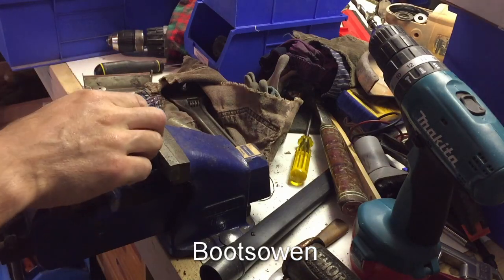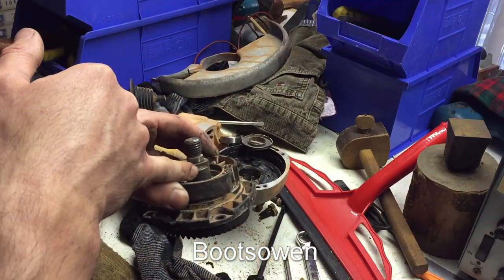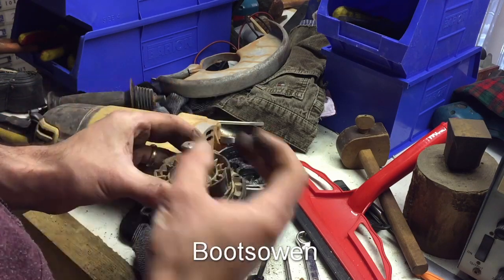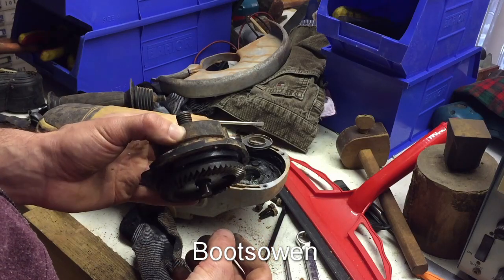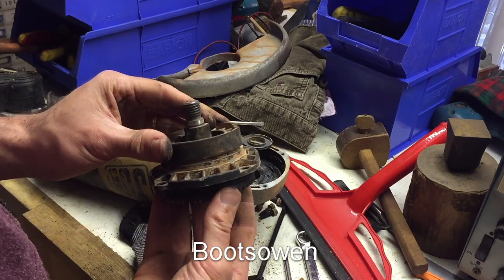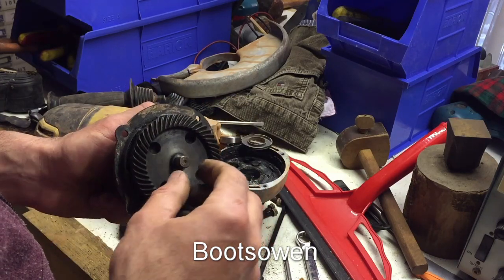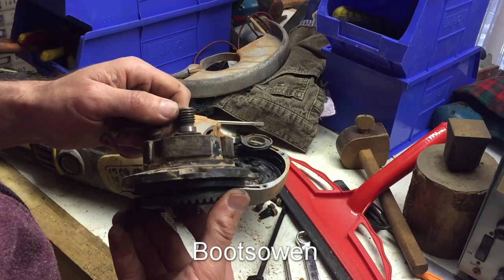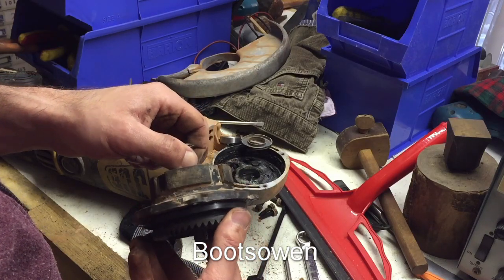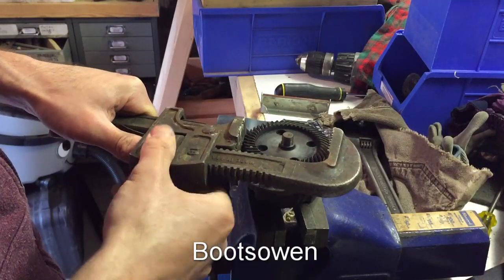Something's shot off there — another little bit of plastic. I don't want to saw it in half because that will ruin it. The shoulder on this is on this side of the bearing, so the bearing has to slide off that way. But it can't slide off that way because this is in the way. So there must be some way to split these two bits — it could be a heat fit and a one-time operation, with this bevel gear pressed on there in the machine. What I might do is put that in the vise, put a Stillson around here and see if that helps. We're on the limits of what's possible.